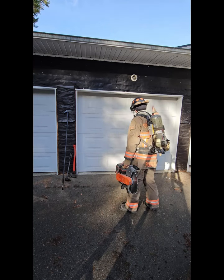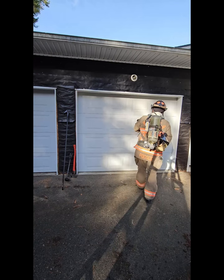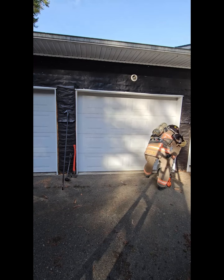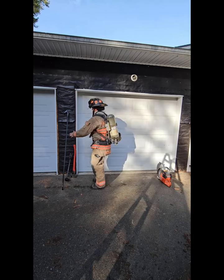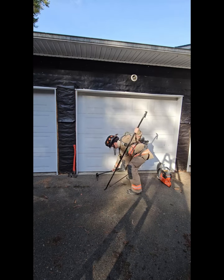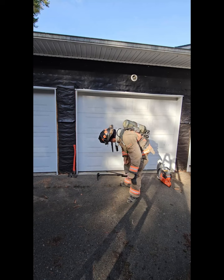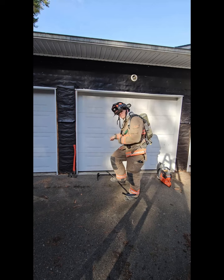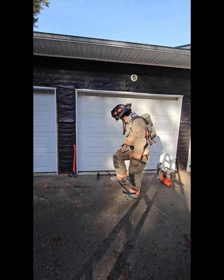After I've cut across, I want an intersecting point that's going to come straight down. I'm going to come up and bring it right down to the ground. Now, in order to get that full cut near the bottom and get through that reinforced piece at the bottom, you're going to want a bit of lift. I can get that if I tent my bars, get my hook right in under there, and get that leverage to bring that up and make my cut down deep with just that little bit of give I get from pulling that up.